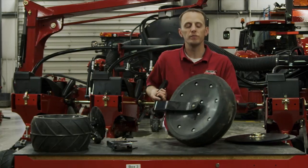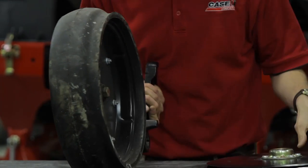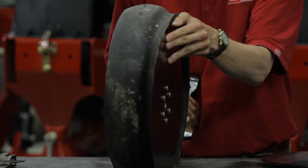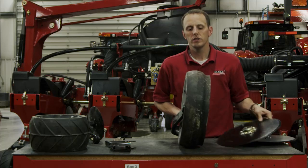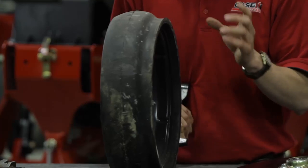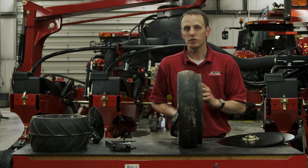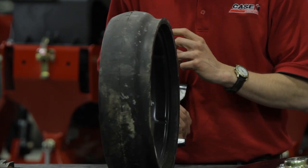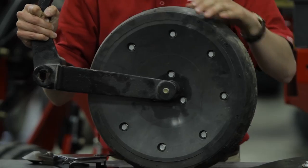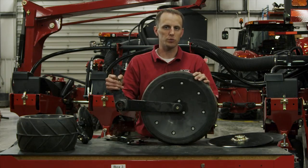The pulled-style gauge wheel has an indentation along its edge that mates right along the edge of the opening disc. When soil comes out of the trench, it is stored in the edge of this gauge wheel, resulting in a very soft sidewall and allowing the seed to fall into a very soft seed trench. This also helps keep the evenness of that row unit at an even depth position, which is another one of those agronomic principles.